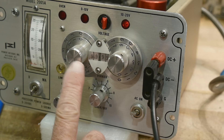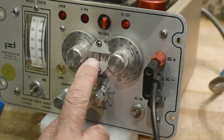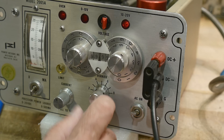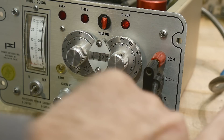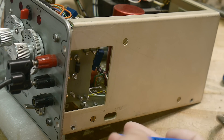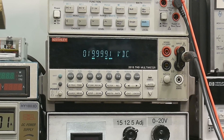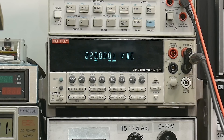I can't set this to 20 — it only reaches 20 when I do this, so 9.9999. I'm going to leave it at 20 on the dial and work with that. I need to adjust R17, which is over on the side of the instrument — it says 'cal' down there. Watching the meter and adjusting — there we go, 20. Very nice.